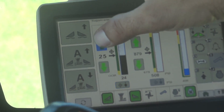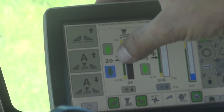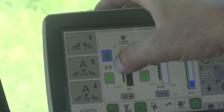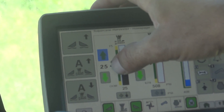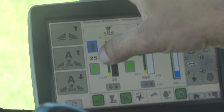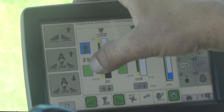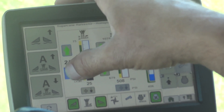If you need to adjust on the fly, you just hit up or down to whatever height you want to cut at. It will not let you select a target above where your Crop Dividers will leave the ground, because the system cannot control when the Crop Dividers are not on the ground. It will not go up any higher than where the Crop Dividers are all the way down. When you lift your Base Cutter to where those Crop Dividers leave the ground, that is your highest point — that will allow you to set at this point.